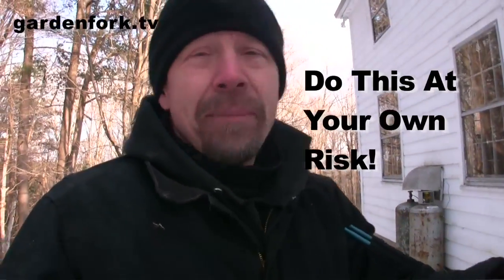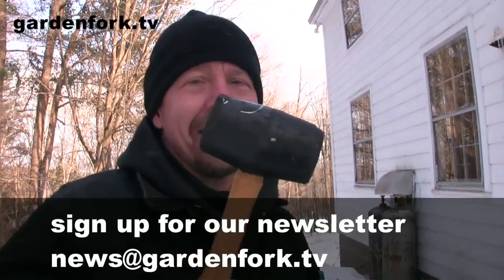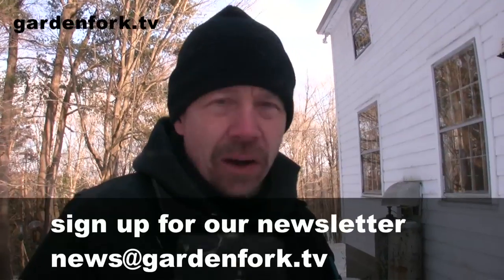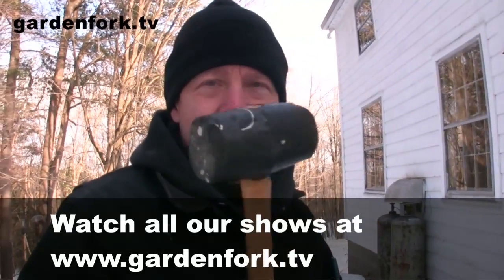So again, maybe hire someone to do this or be extremely careful, okay? The best tool for this is a rubber mallet, okay? Don't use flame, don't use a propane torch to try and melt this ice. I don't think hot water works. You're just gonna put more water in your house. But we're gonna climb up and try and break the ice at the bottom of your roof, okay?